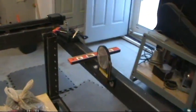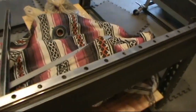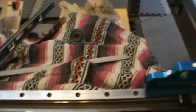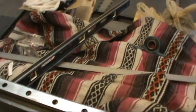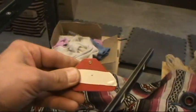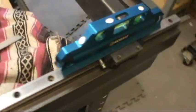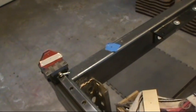That's what's frustrating about this process — it's crucial to get everything aligned, level, straight, and flat. What I've done now is shimmed everything up and then came up with a system using my laser level. On the other end of the block I have a little indicator — a piece of tape with a mark — and it's magnetic. Theoretically, if this end of the rail is aligned and level with that end, the laser should hit that mark dead-on.